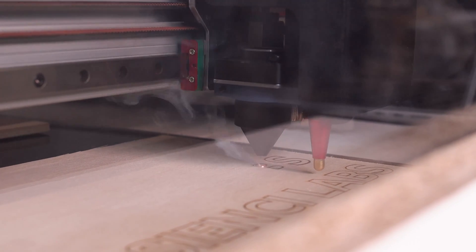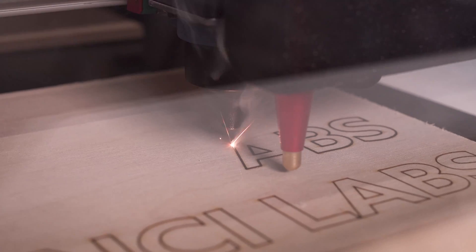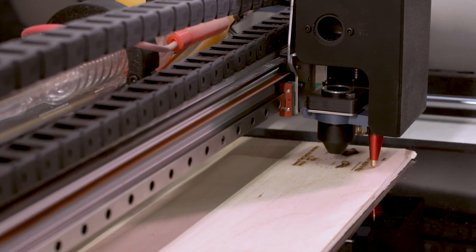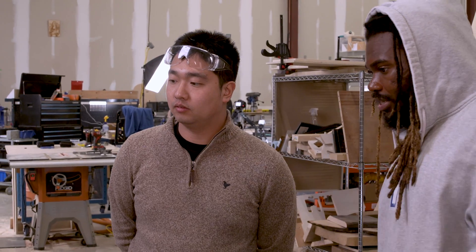At this point we're pretty familiar with CO2 lasers — we've been using them in-house for manufacturing. Anytime you see an acrylic part of your Long Mill or accessory system, that part is cut in-house on our CO2 lasers. We're very familiar with the performance we're aiming to get. Now we just want to make it more accessible for the hobby market. In order to get a large upgrade in power, speed, and form factor, you usually have to pay too much in the hobby space, or go overseas with no support. We're trying to bridge that middle ground. The rough specs we're looking at are a work area of 24 by 36 inches, roughly 75 watts of optical power, and a max speed of about 600 millimeters per second.